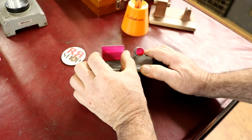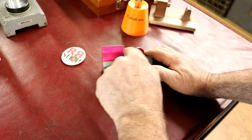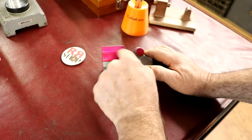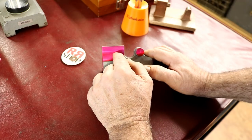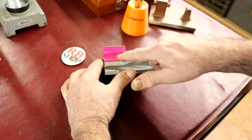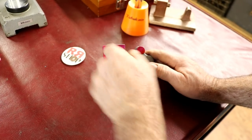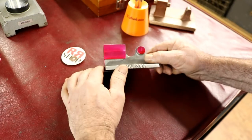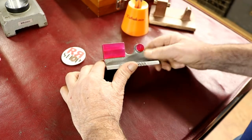Because I changed the length on the one end a little bit, it gave me a little more clearance on the end of the connecting rod, and it fixed the stroke a little bit by moving the cylinder back a little bit. Aesthetically, I think it will be a little better looking, and I think it's actually going to work a little better because the port lineup should be a lot better, especially on the rotational part, not going past the port so much. The model looks real good, and so that's why I've already machined this one a little bit. But I made the cylinder the same